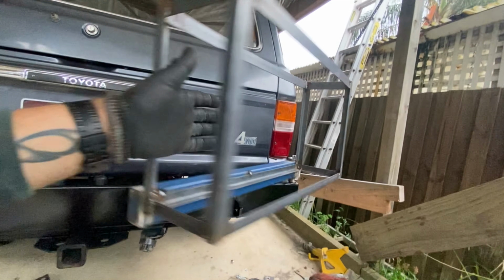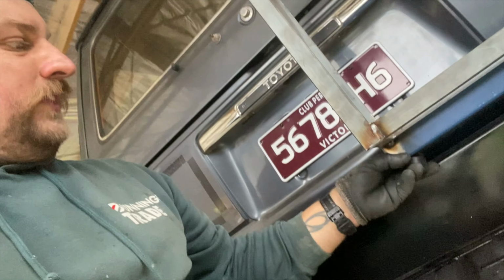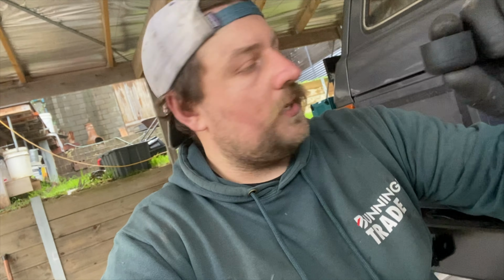So cool. In addition to all this, I've just bought some little rubber stops. They're going to go on the underside here. And I'm going to put them either on a thread or just pack them out so that when they sit in, they're a mil clear of the bar. And then when it clamps down, we've got a nice rubber bearing onto this so that in shakes and bumps, we're getting as little movement vertically through corrugations and all that. It's all going to be absorbed directly and not through all my shitty welding.